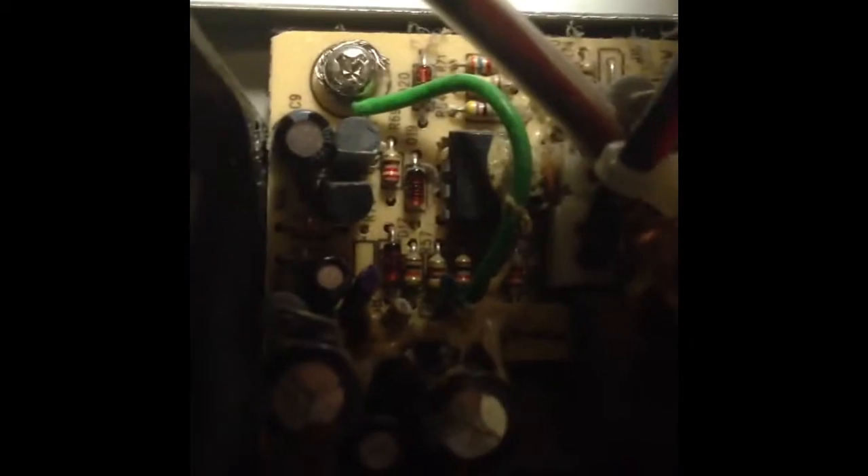What I'm going to do is cut this green wire down and then connect it permanently to ground so that the switch on the back of the power supply will turn it on immediately. You can see how it's been cut down and connected to the casing. I then soldered the yellow wires and black wires into groups and connected them to alligator clips for the final supply, and kept the red wire for a five volt supply.